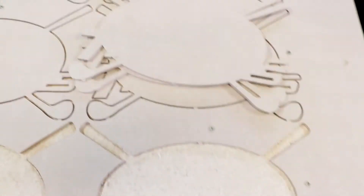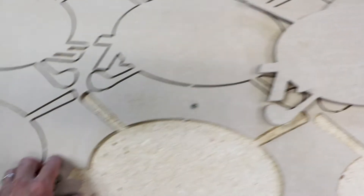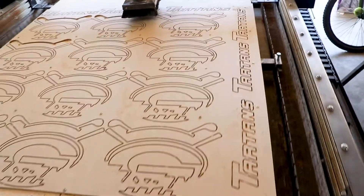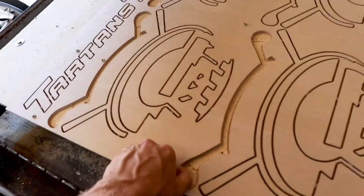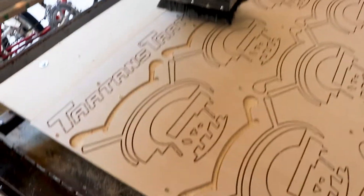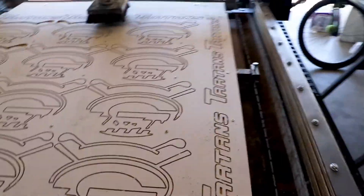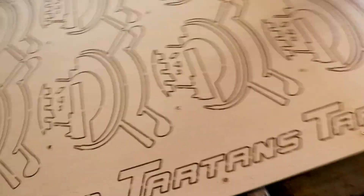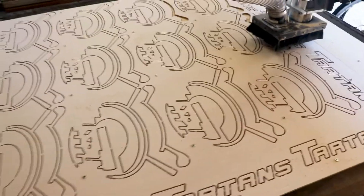I pulled out some samples and they had cut through pretty cleanly. There was a little chatter on some because they were below the cutting point, but all of them seemed to be cut out. Running the job overnight, I think 99% of it cut out well. My spoil board was a little high on one side so I lost a couple of surrounds, but there was very little sawdust. Now the challenge was to pull all the items out and separate all the tabs with the chisel — that's a lot of chisel work.